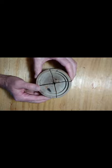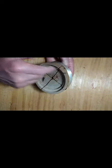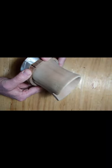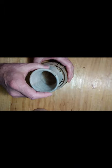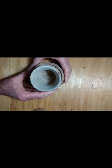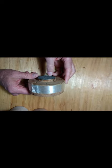Now, I like using this chuck because it's really quick. As soon as I get it in the lathe, I can turn whatever size I need to hold this particular cup. Then I take all of this off the lathe. I put another blank on. I turn a deeper, smaller hole. And I can hold this size cup. I take this off the lathe and I'm ready to run another size. And I've had a lot of luck with these.